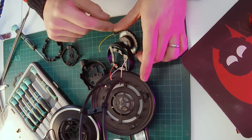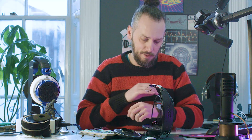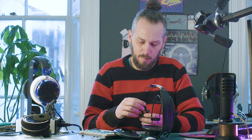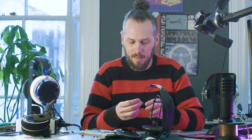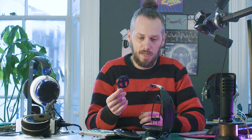Overall they're not too difficult to get into, but there are some booby traps. Certainly when you're desoldering, you've got to watch out for not overheating the driver — I've had a couple that have kind of died in the past when I've got them too hot. We use silver solder here, so our soldering is normally quite hot. I'm hoping to reproduce this in CAD so that we can make some of these with a four-pin socket, because as standard these are glued in or possibly even moulded in place — they don't unscrew. The only way to get them out is to heat up the socket, but that kind of slightly melts the plastic and you can tell it's been done.